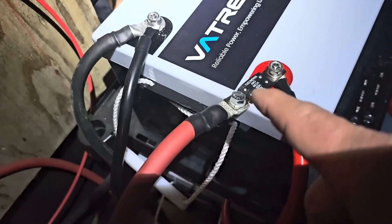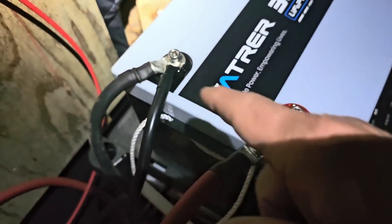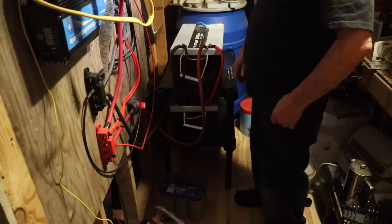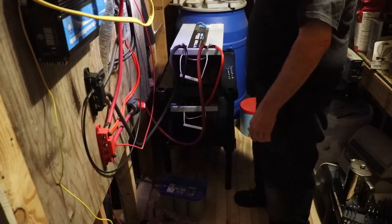So this is connected to the main box, and I've got a breaker on there, a fuse, and then that's connected now as well. If everything works right, we should have power coming on here. It says I've got 8.4 volts coming in from the solar panel right now. Let's turn this on and see what we got. And I'm now at 13.7 volts on the system.